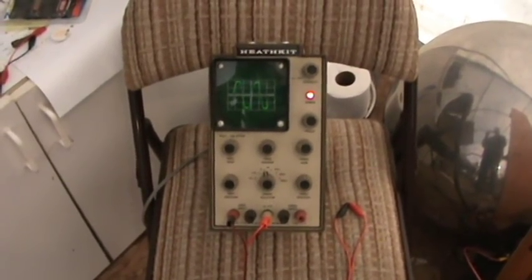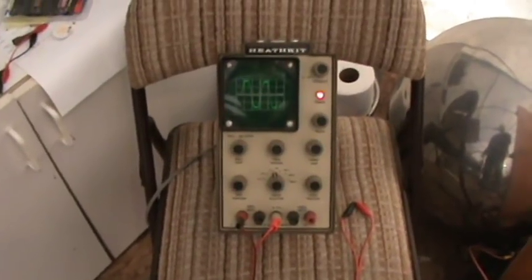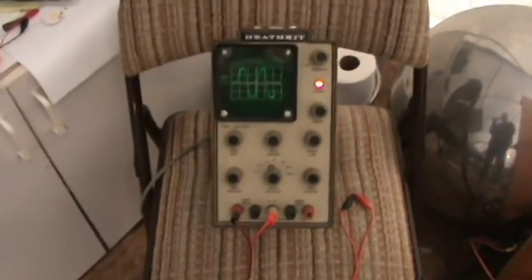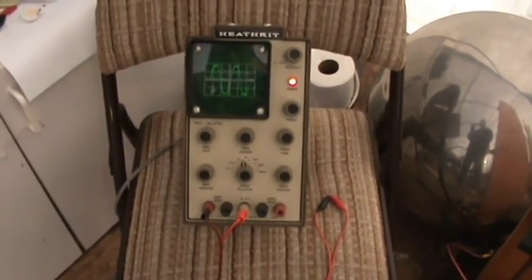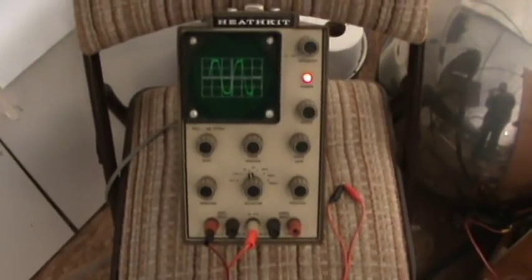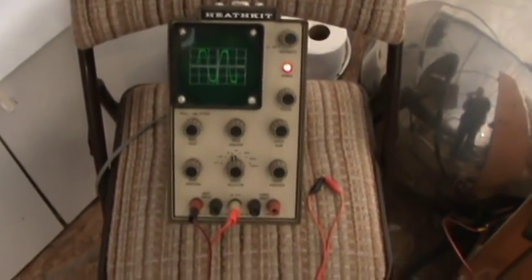The simplest type — I figured if I'm going to start with something, start with this. The thing is I know very little about how to operate these scopes — quite confusing to me. I know electronics, but there are so many ways to hook these up. I actually got the book for it too, but it mainly covers assembly and simple operation. Right now I have it set up at one volt peak to peak, using the 60 hertz line coming in, adjusted according to the instructions.